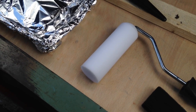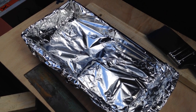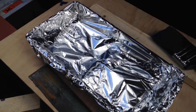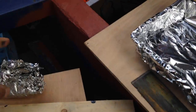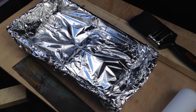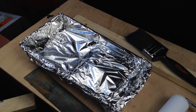I'm just using a small foam roller, a medium sized brush, and a small rolling tray. What I've done is coated the rolling tray in aluminium foil and you put the paint into that. Use the roller, and then when you've finished, you take the roller off, wrap it all up inside the aluminium foil, and it makes a tidy little bundle. Your tray is nice and clean and your roller is disposed of — you don't get paint everywhere. It works really well.